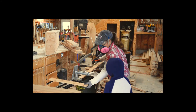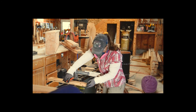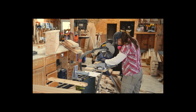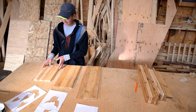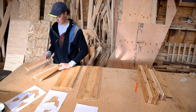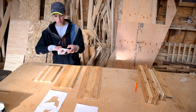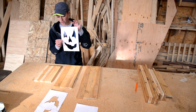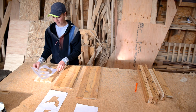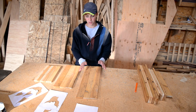If you would like to make an exact replica of what we are doing, you can find all of our measurements and instructions in our plans, which we will link down below. Now we have everything cut out — we're going to take three of your narrow strips, put them down on the table touching. You'll take your template, which I will link below, lay it on the wood, trace it out, and then take these pieces over to the bandsaw and cut them. You'll do that for the small, medium, and large-sized pumpkin.